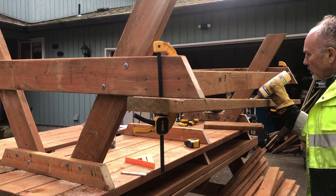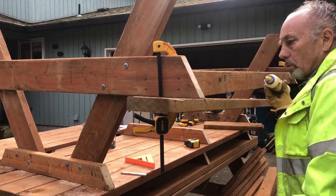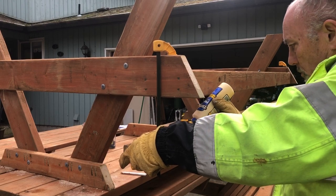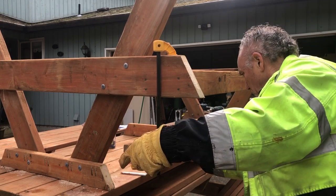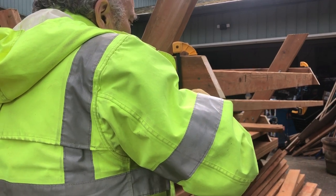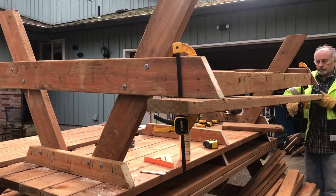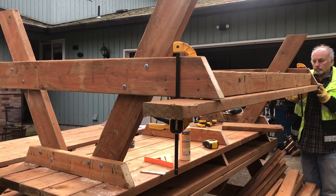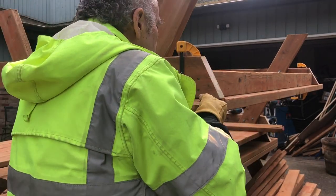Don't get too close to your lines because the glue will squish out and run. Just make sure you get a good amount of glue on there but not so much that it's messy. Hang on to the seat because when you lower the other clamp it'll fall — the board is more than twice the width of the clamp's face. After we get that on there, ratchet it up. We've got the line on there from before so we know where to put the board — it'll move a little as you crank up the other side but it gets us started.